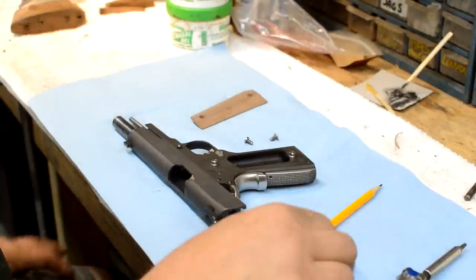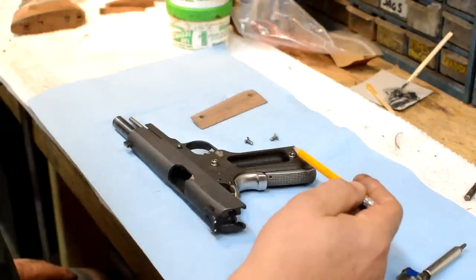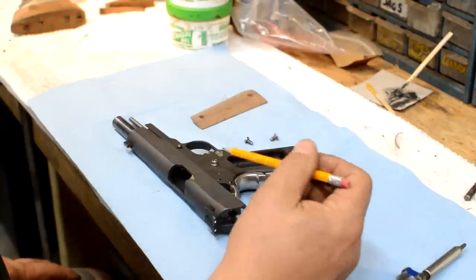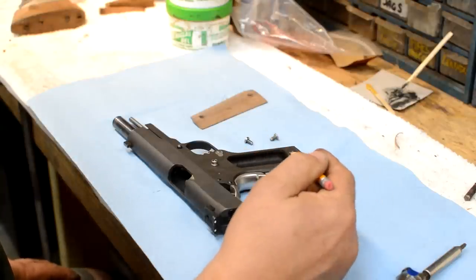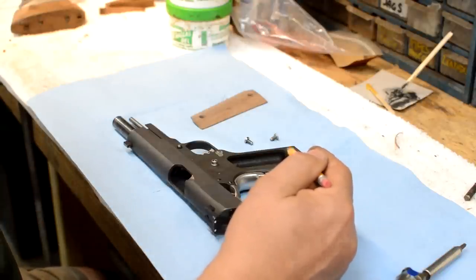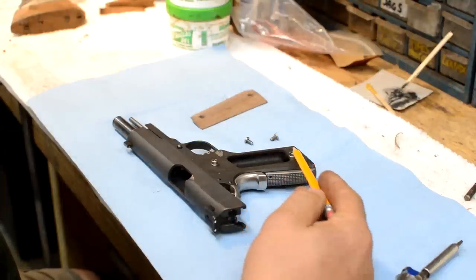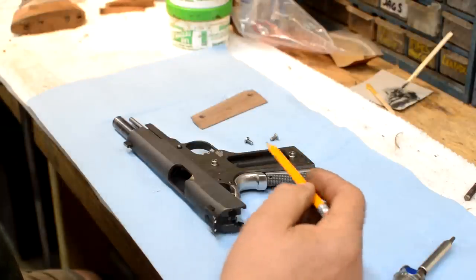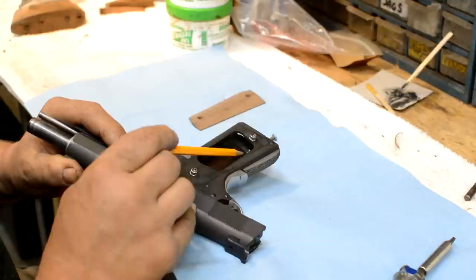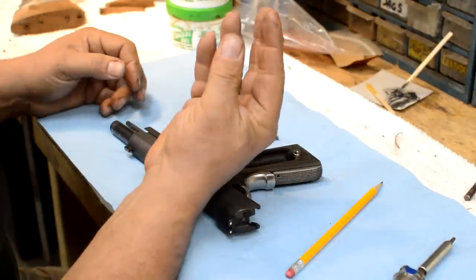That leaves us with the number one thing that gets screwed up about this, which is these bushings. These bushings are here because if you tried to do 50 threads per inch through that much steel, they would strip out in no time. In order to have enough thread depth, the bushings have to go in. But the thing most people don't get about the bushings is these are either red Loctited, or if they're done right, up inside the magazine well up in here, they're staked in right there. Let me rotate that. There's a 4-point stake that goes on in that thing and opens it up like a rivet.